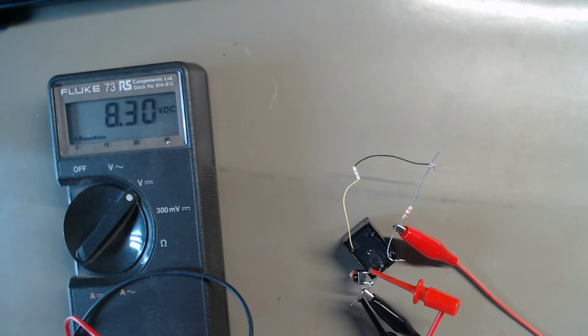And this is what was happening in the unit: the relay was fine, it was off. Now, when the unit is working, it cycles through all the relays looking for a match on the signal path as it changes the capacitance and the inductance via the relays. And of course, what would happen was it would turn this relay on, and then if it didn't find the right match, it would turn it off and go off and do another relay.